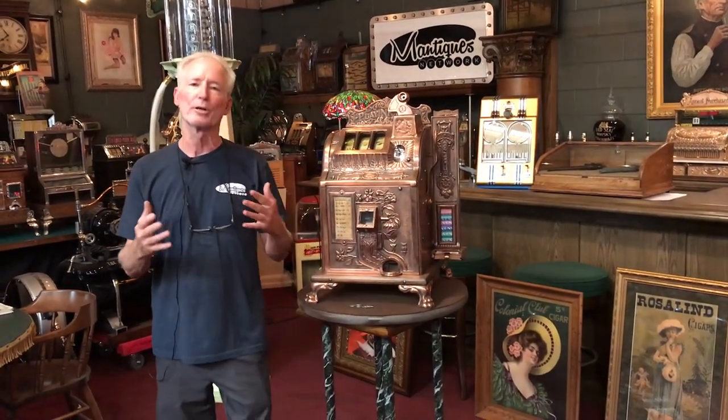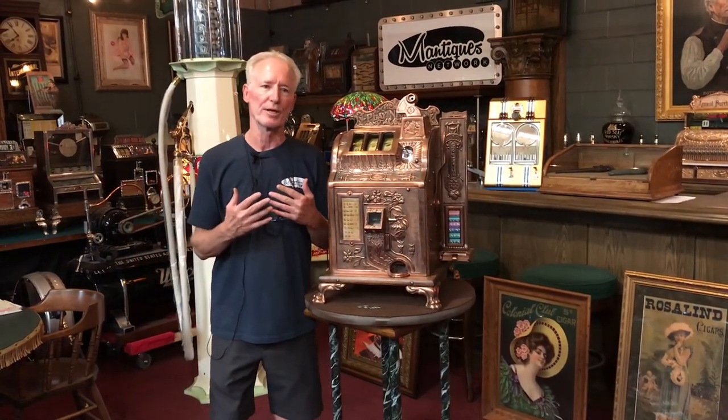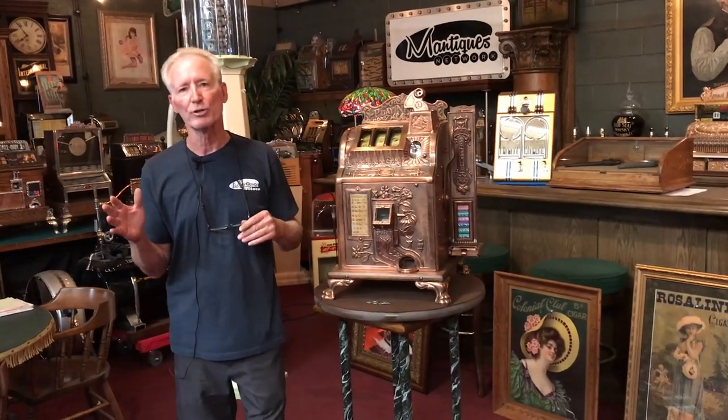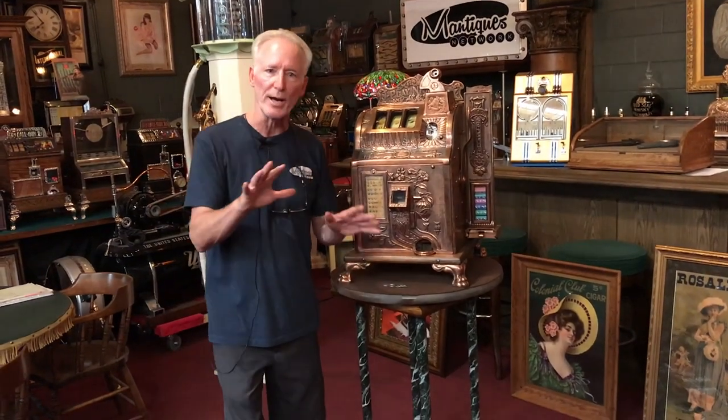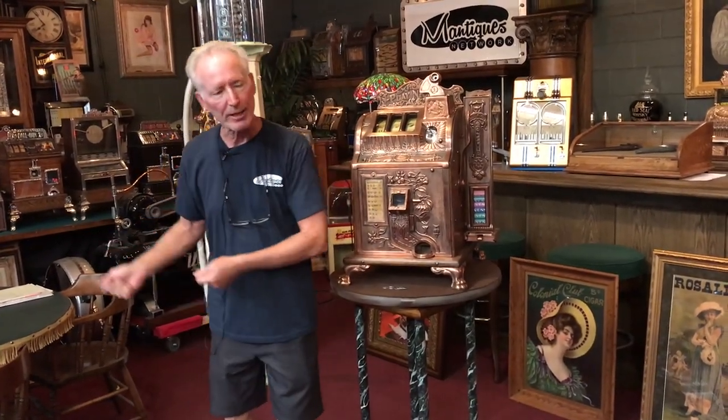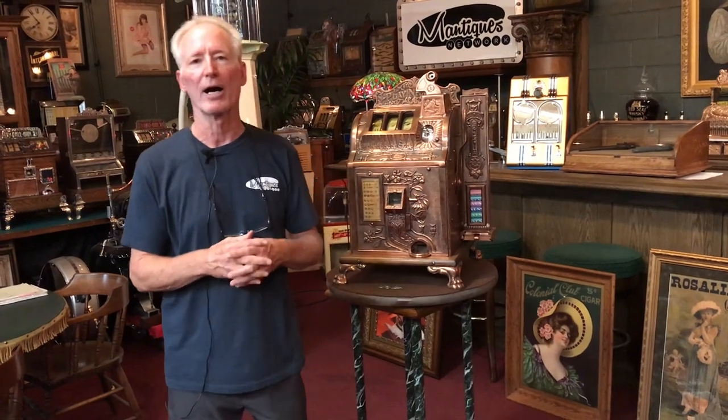What I did is I kind of like to switch things up instead of going with nickel — I wanted to do a nice antique copper finish. I sent this out to my platers, had it done in copper. When it came back it was in bright copper, and then we here in the shop antiqued it. We buy an antiquing spray, spray it, it turns it black, then we take it to our buffer and start polishing the highlights.